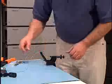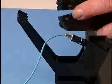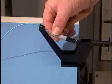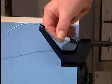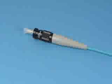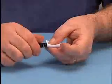To aid alignment, rest the crimping tool on the connector body and, using the middle die position, crimp the sleeve. Align and press the rear housing assembly into the front housing until you hear a click. Remove the connector from the installation tool. This completes the installation procedure of an OptiMax ST-compatible connector onto jacketed fiber. The connector must be cleaned before it is installed in the fiber panel.